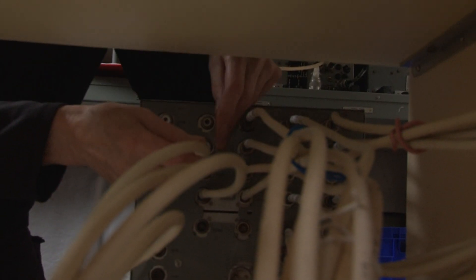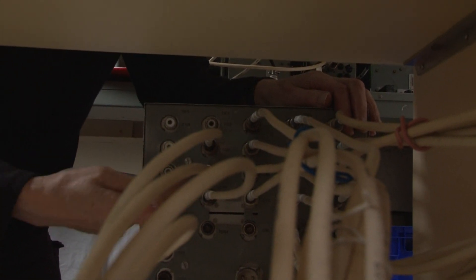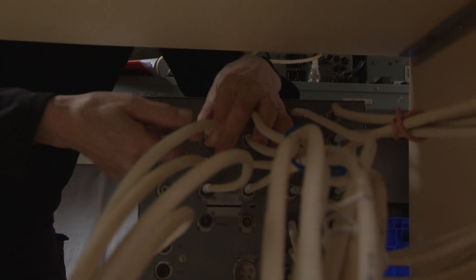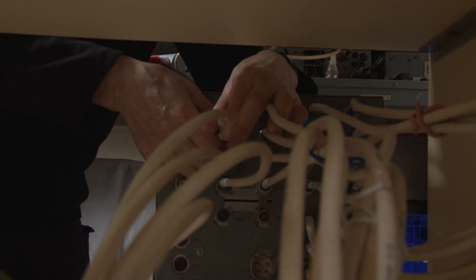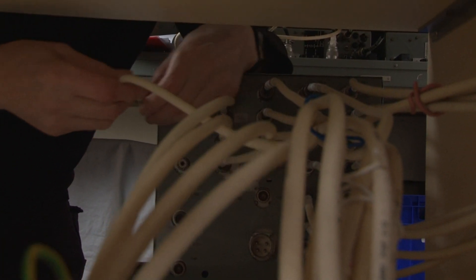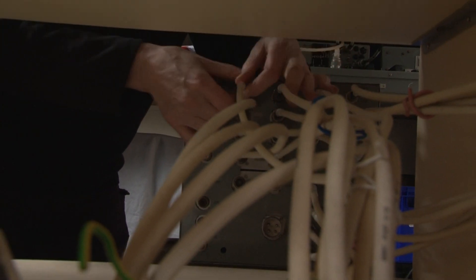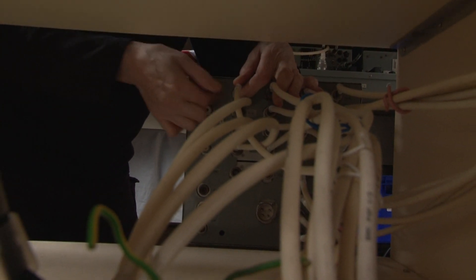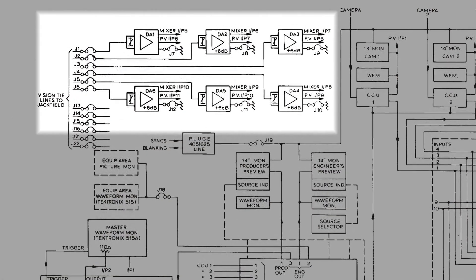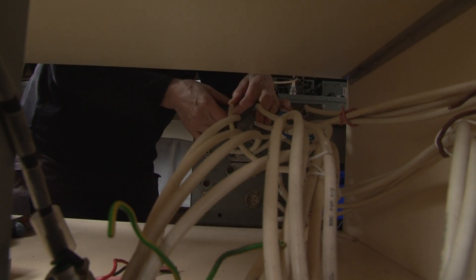Output 3. I've arranged the outputs 1, 2, 3 so that there's a certain degree of logic, and these PL259s are all screwing up quite nicely. So that's the input going in to DA4, and they're not arranged as loop-throughs 1 to 6, so they terminate internally.